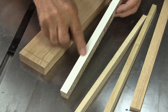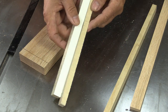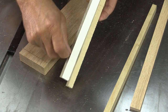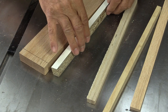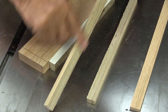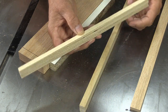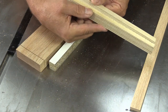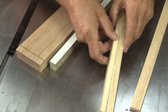This is the piece I cut here and if you look closely there's a little bit of tear-out along that edge, but for a ripping blade it did a pretty good job. On the plywood, ripping with the grain did a very very good job. Cross-cutting against the plywood is another story — we're dealing with pretty thin veneers here and you can see there's a fair bit of tear-out along there on the plywood, so it's not really good for cross-cutting on plywood.